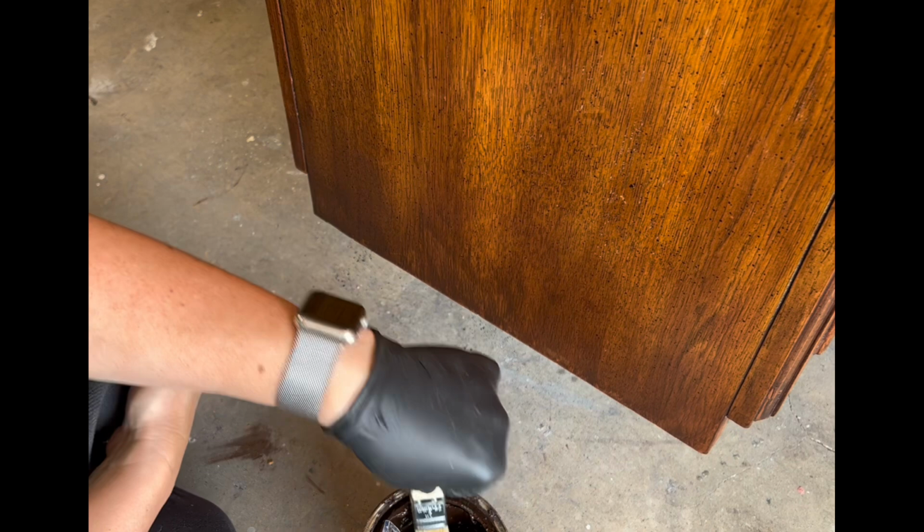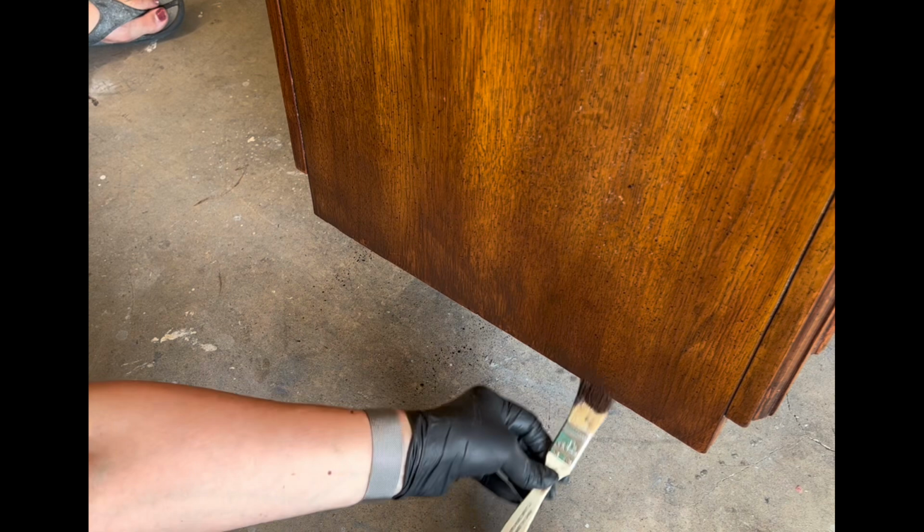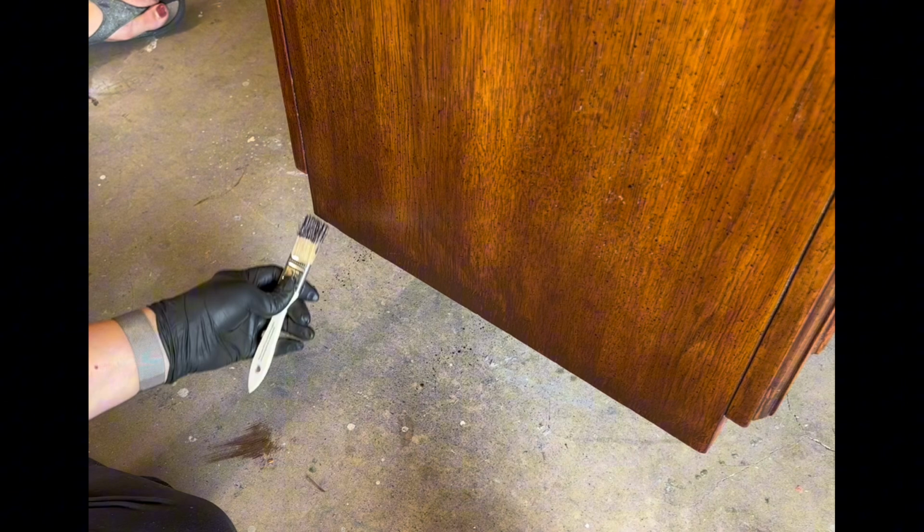The more that you do it, the more that you kind of mess with it, it'll blend in. You can also use a blending kit. I'll link it in the description, but there's also areas if you just can't quite get it with the gel stain, they have little tubes that you can use that are all different colors and you can blend it. You're basically using acrylic paints and you're just painting on that wood grain.